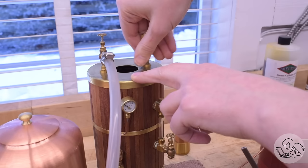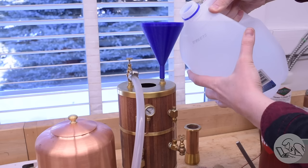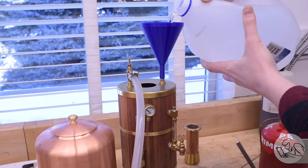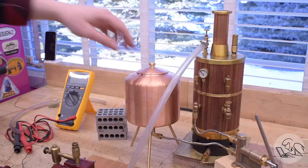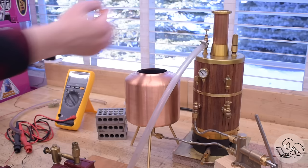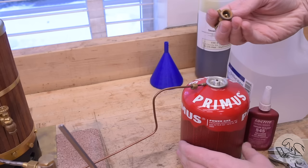Now let's get the boiler ready. First thing we've got to do is get some water in there. This boiler does not have a fill port, so I just take the safety valve off and use that. I 3D printed a custom funnel that threads onto that port to make this easy. I use distilled water in this boiler so it doesn't fill up with scale and calcium like it might with tap water. Fill that up until we've got a nice reading almost all the way up on the water sight glass. Next I fill the Ron Covell water tank — a friend of the show, Ron Covell, made this beautiful water tank for me as part of the feed water system for the boiler. Then I prime the feed water pump so that when the boiler needs water under steam, we're ready at a moment's notice.